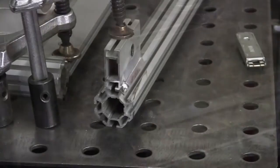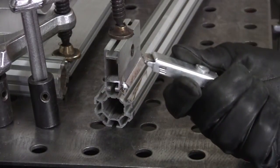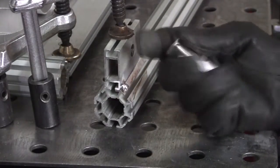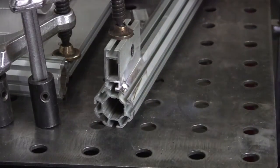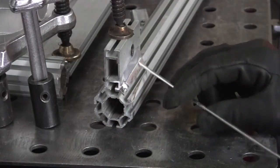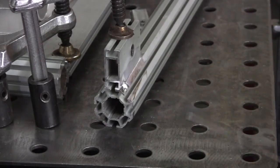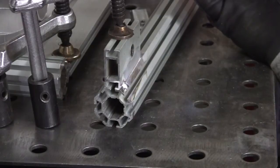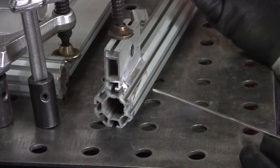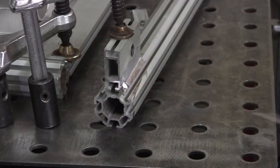Little hot. Okay, I got this thing one tack on it now, and I took this out because we had to make sure that when I weld it, this doesn't get stuck to it, or it usually causes like a heat sink. And then also here, there's coating on this aluminum. Make sure you get all that coating off. Now, not just this project like I'm doing, but just double check on that aluminum. If you're doing something yourself in your garage or whatever, make sure all this is clean. Real clean. Otherwise you're going to have problems. I did it kind of fast, so we'll find out whether or not it's really going to work for me too. But let's just run a bead right quick.